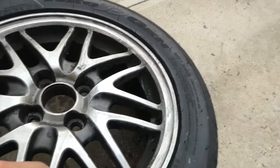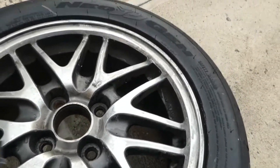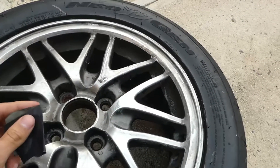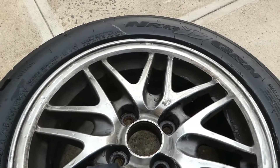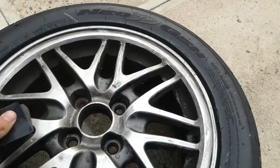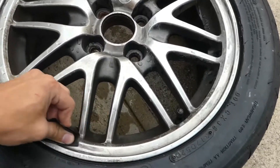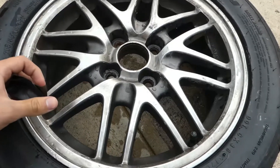I had to take the camera off the tripod because I want to show you how it's going. You're just going to keep running it through the 400 grit until you get a nice smooth layer going on. You're going to repeat the process with the 400, 600, 1000, and 1500. I'm going to get back to you guys when I get to the 1500, and then we can get to polishing so we don't have to sit here all day — it does take a while to get it all done.